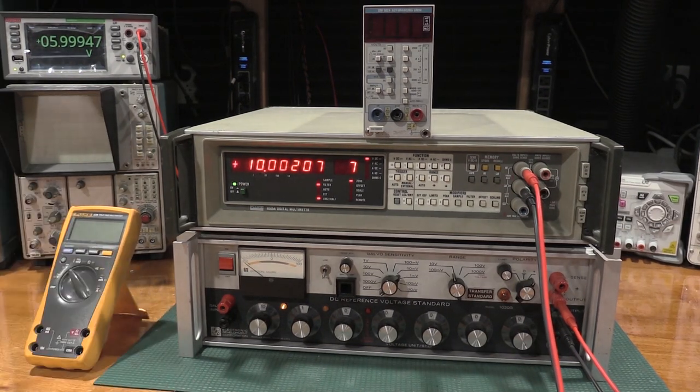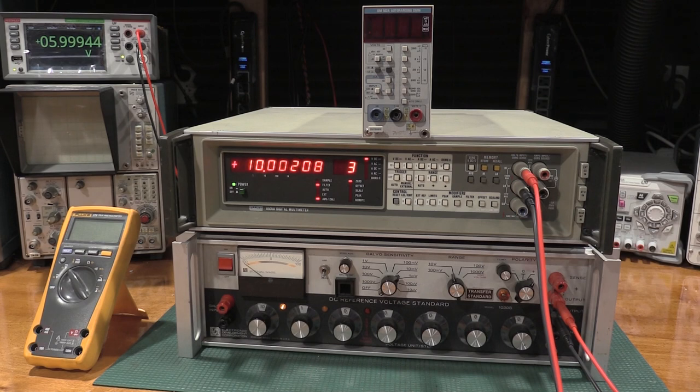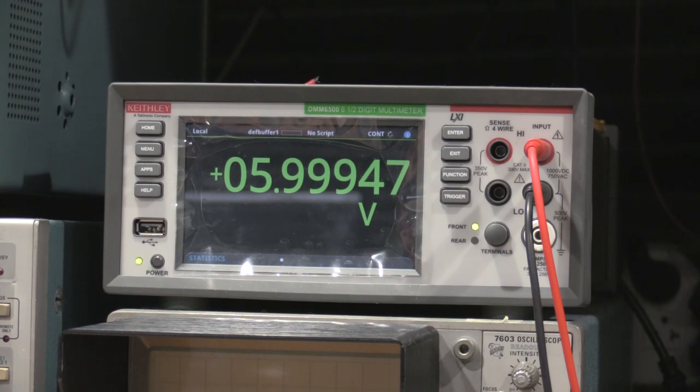Having established that stability was important — now how do we get started? I had to start somewhere and was in a vacuum. In the beginning, my basic DC, AC, ohms, and current accuracy foundation was the 6500. For doing 3.5-digit multimeters, that was fine — I have way more than 3.5 digits and I have the stability I need. However, that didn't let me work on the Flukes or the EDC.